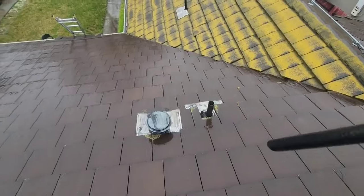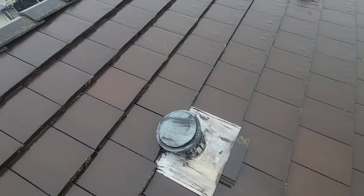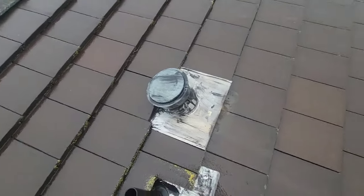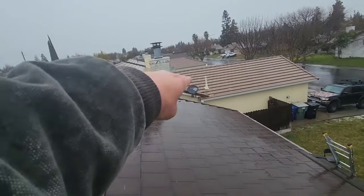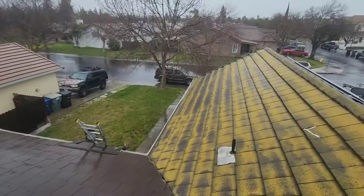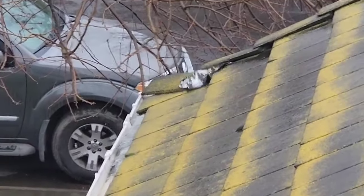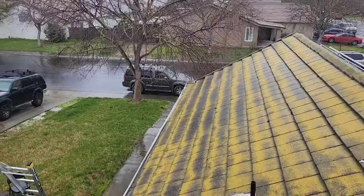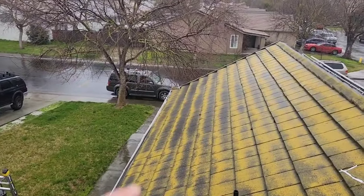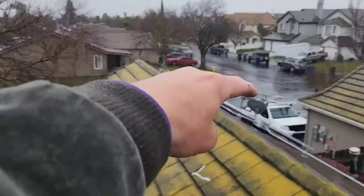All the vent jack flashing — there are a couple of slid tiles here. I can go ahead and kick that one back up to where it belongs. I think that'll remedy your problems. We'll go around the chimney to make sure all the flashing around the chimney is good. I did notice in the front area that these ridge caps — the end caps — this area right here is not really that great and I suspect it's going to cause an issue in the future.